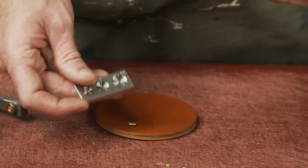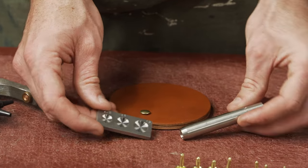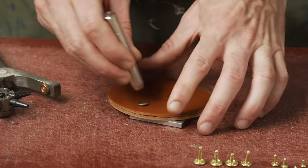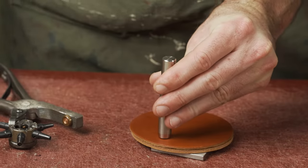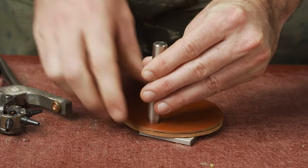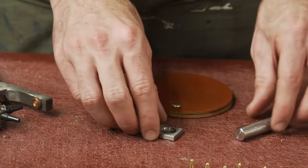This is one of our hand tools — our basic setup. We've made our tools to fit our rivets perfectly, so there's not going to be any doming or flattening of the cap. Two to three hits and you're set perfectly. You don't want to over-hit it. You want to go right in the middle with medium strength hits.